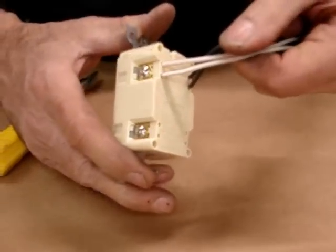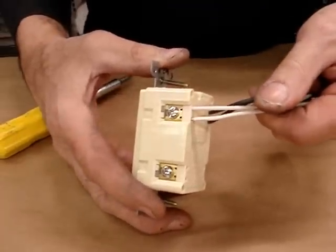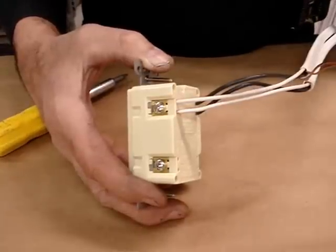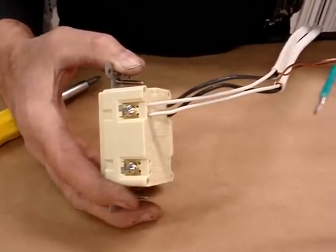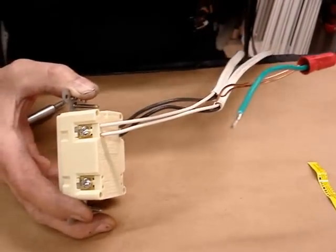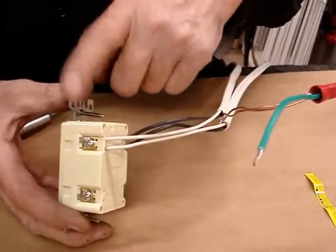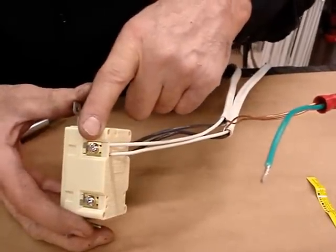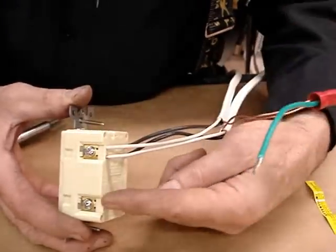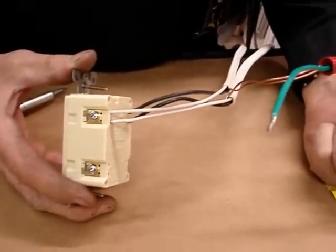When they were wiring your house, they brought electricity in and out of the bathroom, and they could have gone downstairs to your sump pump or freezer or refrigerator. So if this device trips because your daughter was using her hair dryer and tripped it without realizing and left, from that moment on your fridge or sump pump was no longer getting power. The other thing that can happen is the power leaving here could be going to the adjoining bedroom.